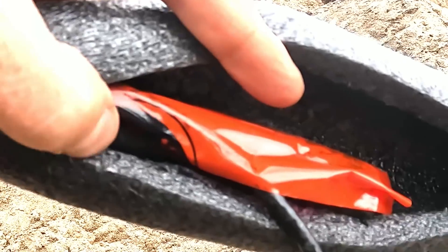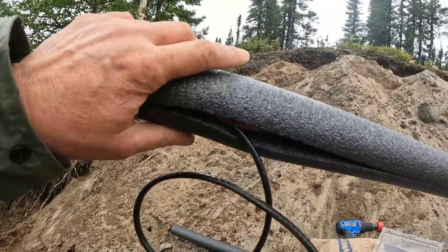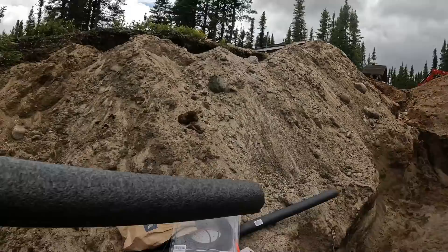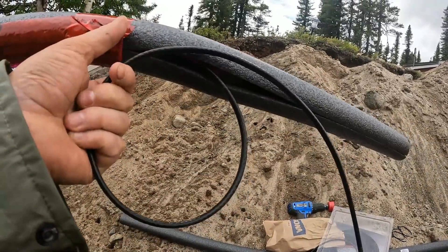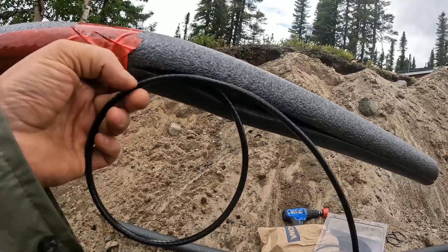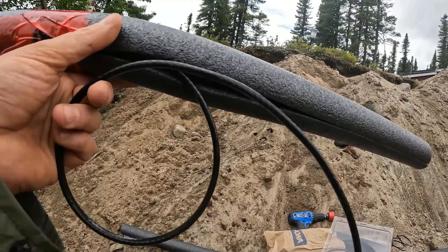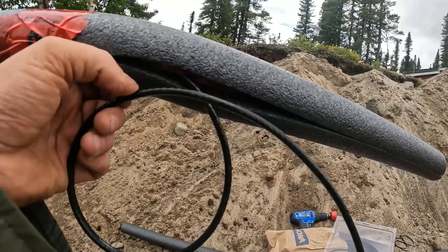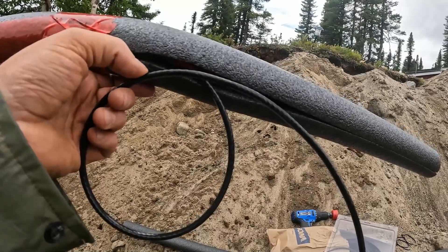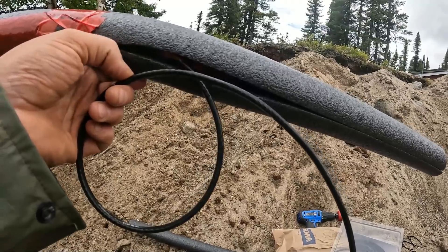So as you can see, that's my water pipe inside, and then I've got the heat trace on that, and then I've got this foam insulation. That's going to be following this water pipe right up to the cabin. Now this heat trace is never going to be on unless I get a freeze. I know in the last video people were saying you can't use this on a dry pipe - well the only time I am going to use it is if there's ice build-up. It's intelligent and it's supposed to be able to sense where the ice is and send the power to heat right to that spot. So no danger in burning up my pipes - hopefully I'll never ever turn it on.